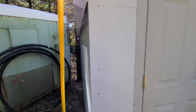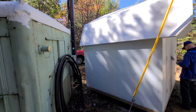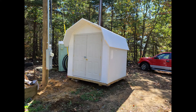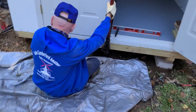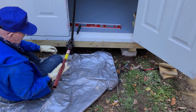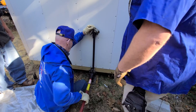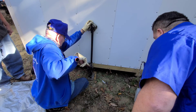AC4DM is unlocking and double-checking things on the inside — there wasn't anything in there but the air conditioner. So we're ready for what is essentially the leveling of the shed. Here we've got it placed; you can kind of see it before leveling. Now we're getting out the jacks and the level itself, and we want to level it left to right and front to back. We're utilizing a particular jack that AC4DM just had laying around, and we're raising it so we can begin to place the pavers and potentially some wood blocks.